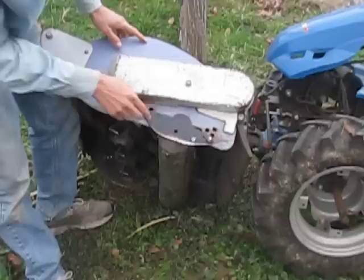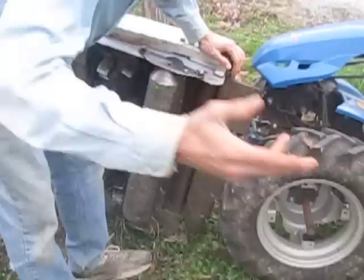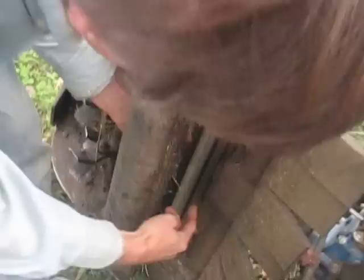The Berta flails also have a removable baffle, which if you bring the camera down here, you can see right here is the baffle. This baffle, being removable, is held on by 4 or 5 nuts across the top of the flail drum on the top of the mower. But basically this baffle being removed or not removed dictates the amount of chopping the blades are going to do before the material discharges, because this is the area that the material gets spit out of right here.